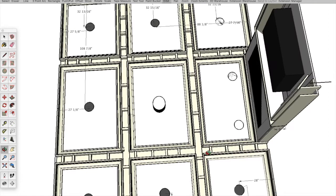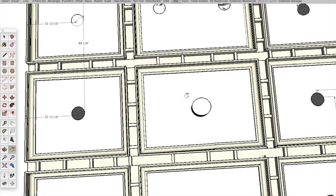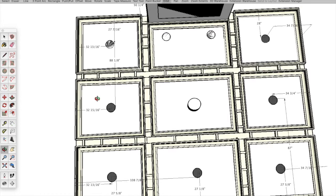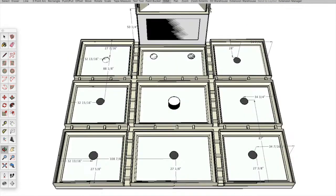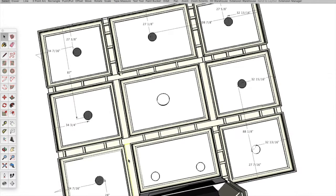Underneath the covered ceiling are these two-by-six beams with these little chunky three-inch wedges. Now on the sides of that, you'll see one-by-six, and then eventually on the top of those beams, you'll have one-by-six boards that will cover up the entire framework. Once everything is wrapped in the one-by-six boards, then you can add your crown molding to each box of your ceiling.